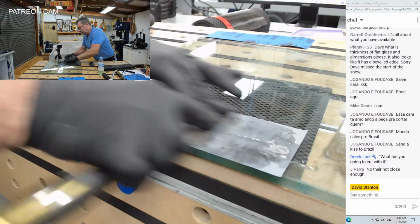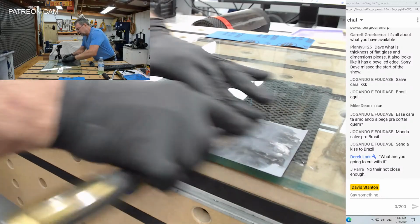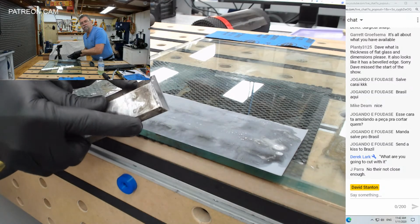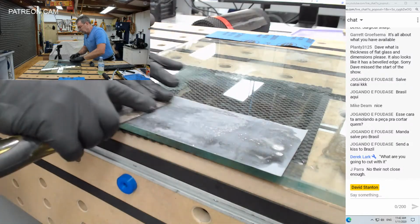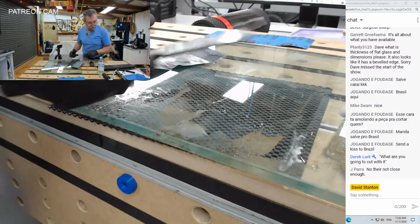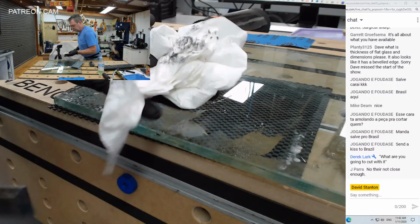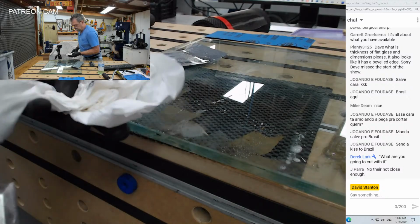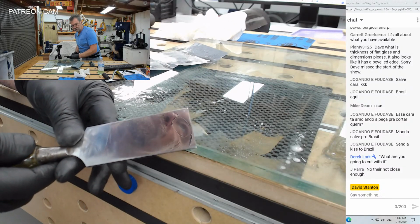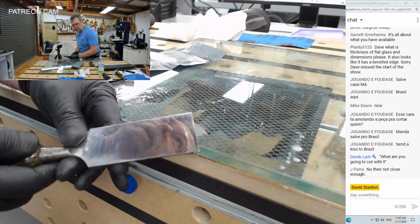All right, we're going to have around about 20 minutes to sharpen 6 chisels. I'm going to do this one as well. This is the one that I started with the manual sharpening. So we're going to start off with a 60 grit belt. Whoop, that happens. I wasn't concentrating, but the chisel was sharp by the time it hit. Have a look. It's just that bit more polished. How nice is that?